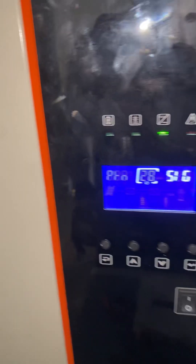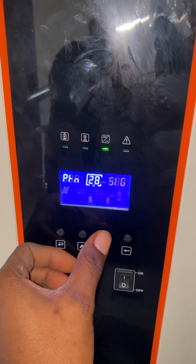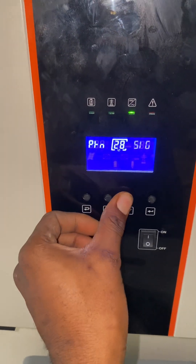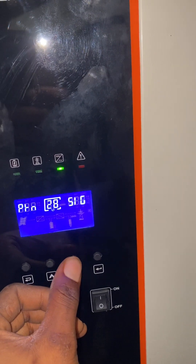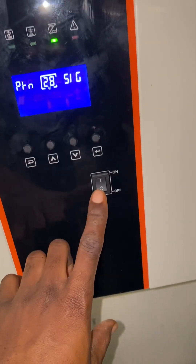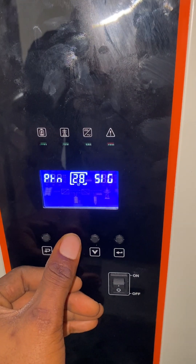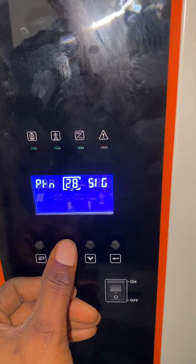You can see both are on single. Now we've paired the two inverters. If you want to put it on parallel, you press this — it will start blinking. But if you press up and down it will not respond. The same goes for this one. If you want to put it on parallel, it won't respond because the switch is still on. Watch as I turn it off — now the inverter is up, the key is working. Single phase.